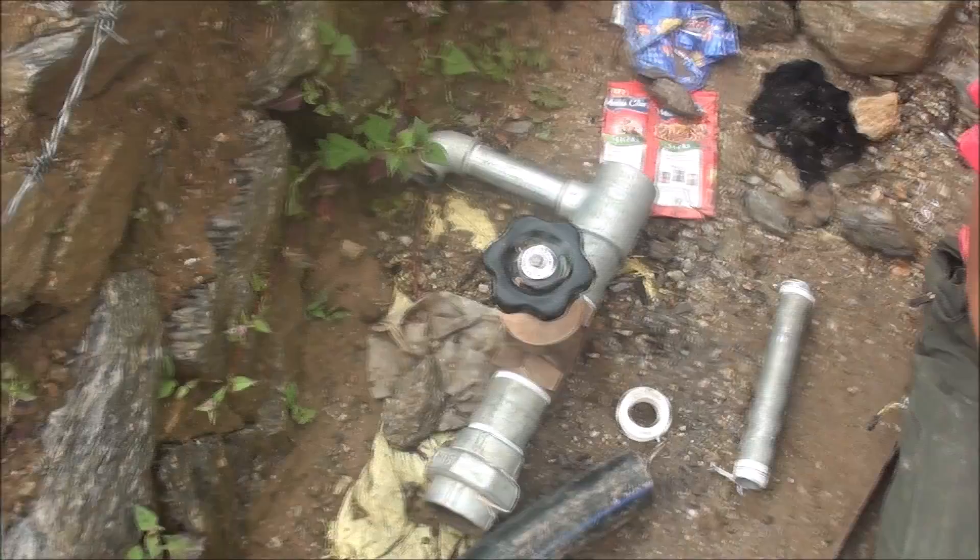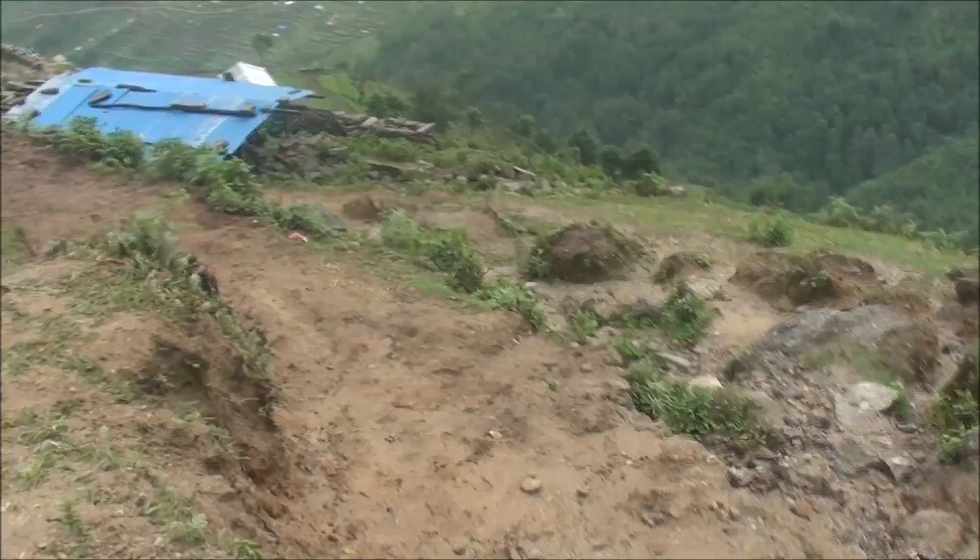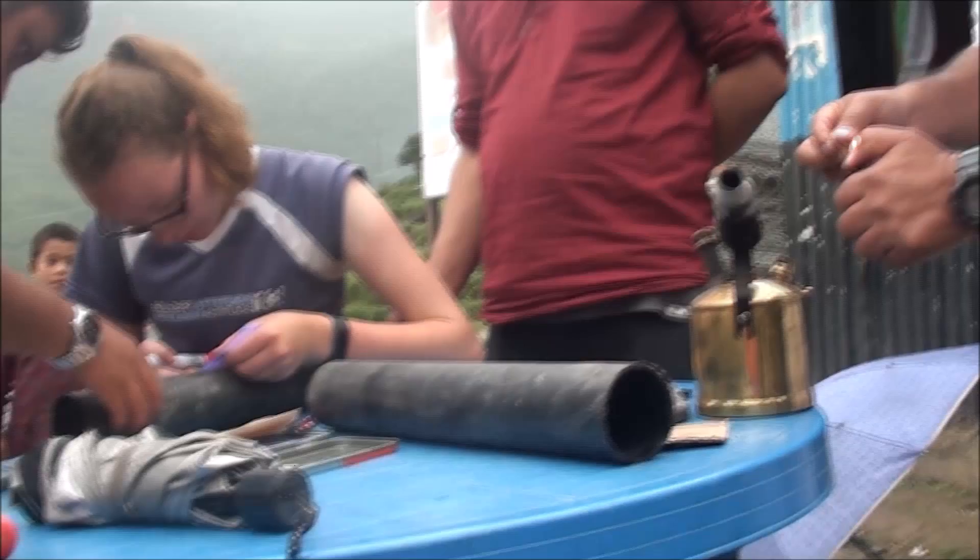They're trying to do the drainage and overflow pipes. We're joining them — connecting it to the system right there — and it'll come out this 63mm. There's an energy dissipation system that we built down there with a couple rocks and pipes. Everything got buried yesterday, and there's still a little bit more 63mm to bury.